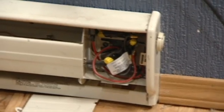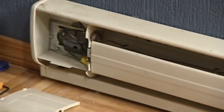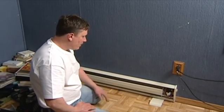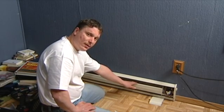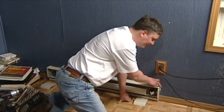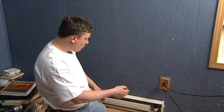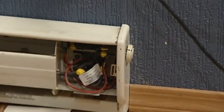On this unit, your power comes in on the right hand side, so it flows through and makes a complete cycle. Up inside the fins of your baseboard heater there's a thermostat — a small wire that runs all the way through. Most likely you're not going to have problems with this, but if you do, on this model we got a dial on the right hand side. When you turn this up or down, that senses how hot your temperature should be and tells your heater when to kick on or off.